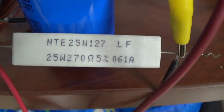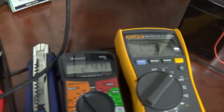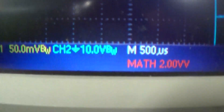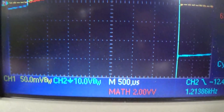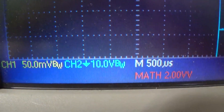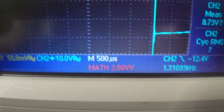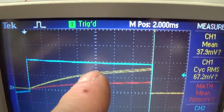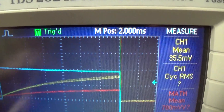This is what's coming back on the flyback side - we have 24.5 volts, 24.4 volts across that 270 ohm resistor. That DC motor is in parallel with it too, so both of those are the loads. Here is the scope shot - the yellow is the current sensing resistor, the light blue is the voltage divisions. Notice that we have four time divisions on this side and exactly three time divisions there, so keep that in mind when we remove the coil from the rotor.